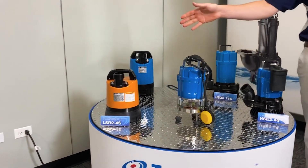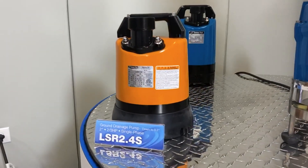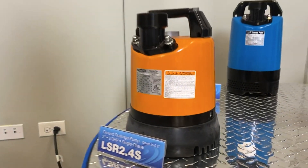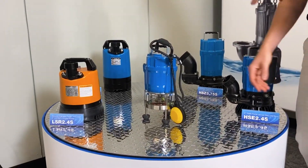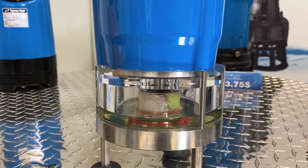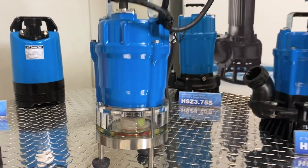The orange pumps on the front — we have our LSR and LSC. The LSR pumps down to 0.4 inches and the LSC will pump down to 0.04 inches. So these are low water-level pumps. And as Jeff talked about, all of these pumps have our patented oil lifter. The oil lifter is fitted around the mechanical seal to ensure that both seals are constantly lubricated even in low oil-level environments.